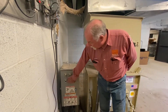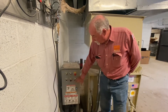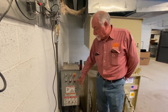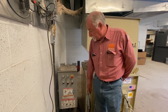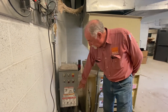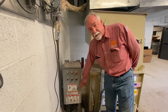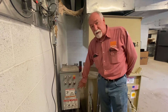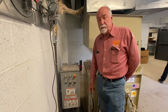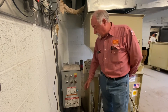You have a reverse button down here if you need to reverse the blade for some reason while it's operating. These are warning lights here related to the auto and also full circuit and part full circuit. This little button here all this does is reset the motor overload inside the control cabinet. If for some reason it's not working you would want to push that button - that will reset the overload so that it will operate if that is the problem.